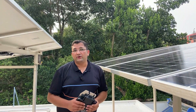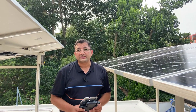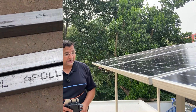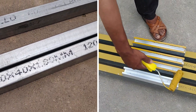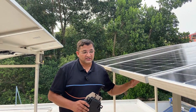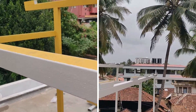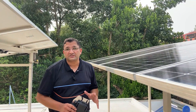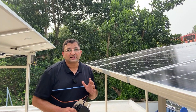The structure has been anchored using Hilti anchor bolts, and the entire structure is made of GI. On the GI, yellow oxide has been coated and then the GI is painted as well. The structure is made completely corrosion resistant — very important because this is the coastal town of Mangalore, where rainfall and winds are heavy. It is critical to design the structure to be corrosion free in such an environment.